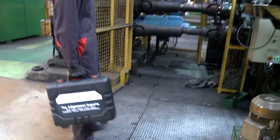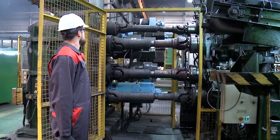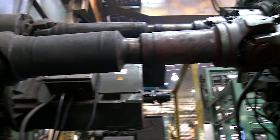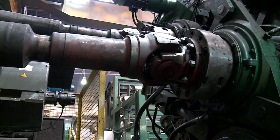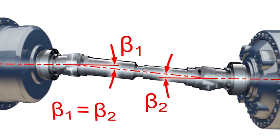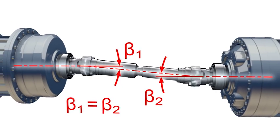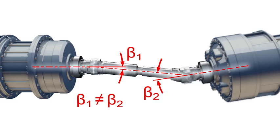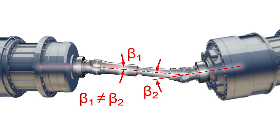We're in a gum factory. Our engineer Mike will be checking the alignment of a cardan shaft. Cardan shafts are used to compensate for an offset between the driver and the driven shaft; however, they cannot absorb large angular misalignment, which can generate excessive vibration. To create optimum operating conditions and lubrication, cardan shafts must be aligned.